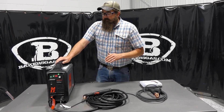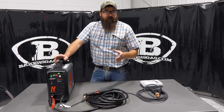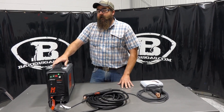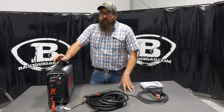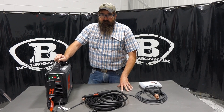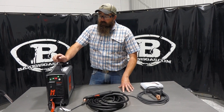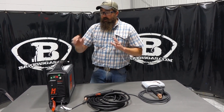On this unit, it is recommended five-eighths inch at 20 inches a minute, and seven-eighths inch at 10 inches a minute — a little bit slower on thicker material. It'll sever inch-and-an-eighth, and you can pierce half-inch material. I've cut one inch with the 45 XP — it is slow, but it does it. It'll walk through five-eighths, half-inch, three-eighths, quarter-inch with no problem.